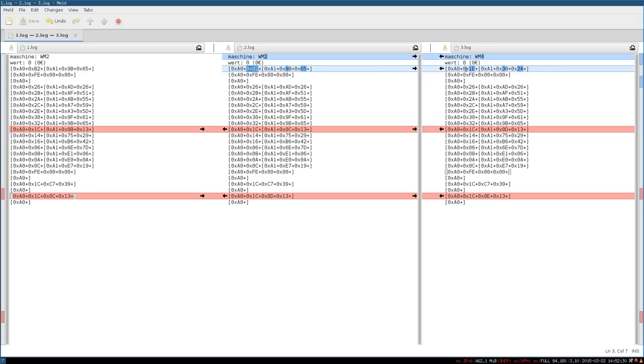But different machines read at different addresses to verify what it means, and the data is not too much alike. All the machines read the same address range, which you see here. So this address range probably encodes the value of the card. And in the end, it writes two things at once here, actually. So here we figured out this is the read counter because it's incremented every time I plug it into a new machine. This is the end of the transaction.